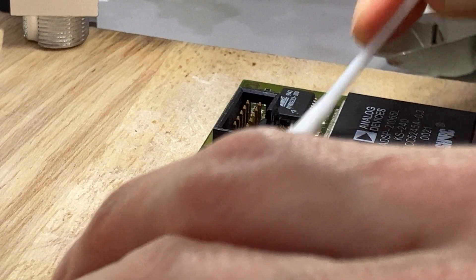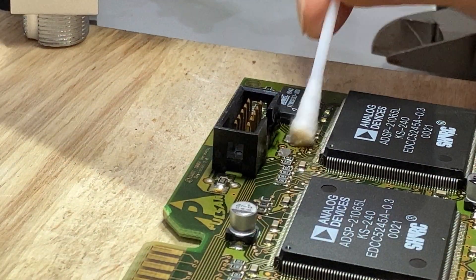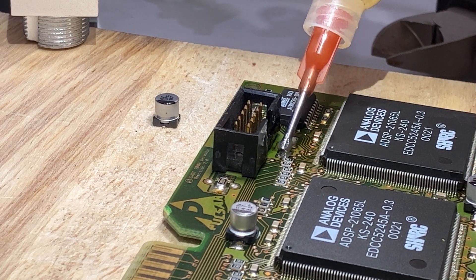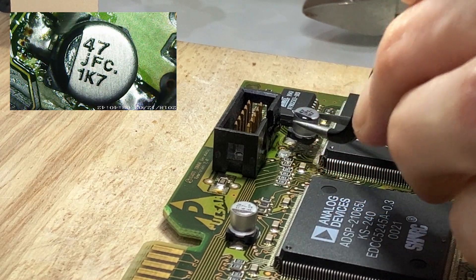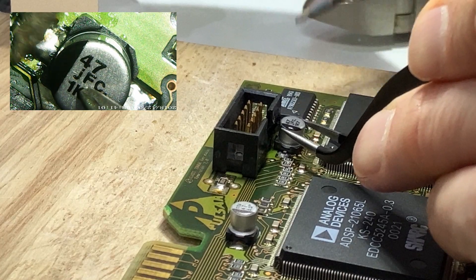Here we can see another one done elsewhere on the board — cleaning off leaked electrolyte using a cotton wool bud and electrical cleaning solvent. I added a small amount of flux to the legs of the capacitor to make it a little bit easier to solder them onto the board, since this is quite small scale work. Placing the component in position — you can see I've already tinned this one, you can tell by the domed solder pads — then just the lightest touch with the soldering iron goes into position. You have to be very careful of all the other nearby components.